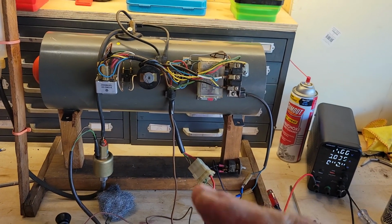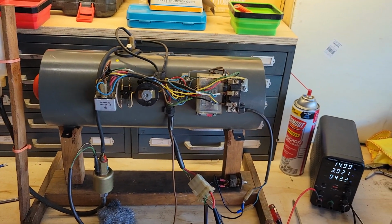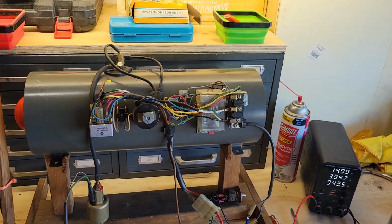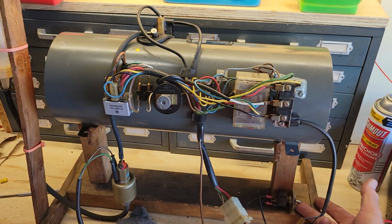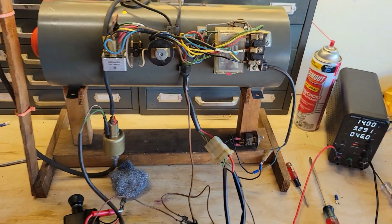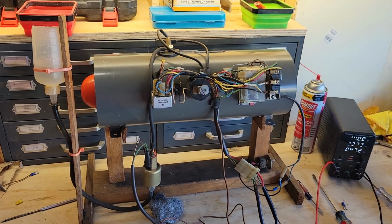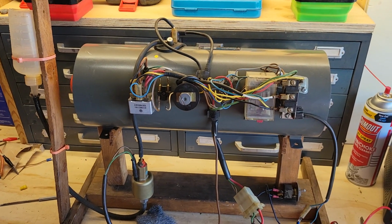They're supposed to run in an up and down fashion, like a wave. They heat up and they cool down, in 45 to 70-second increments, depending on what the ambient temperature is outside. So let's say it's cooled down enough, and the thermostat has cooled down as well. Trick the switch. The thermostat will click on like that again, and this should fire up again and go back into a heating mode to where it's putting hot air into the cabin.